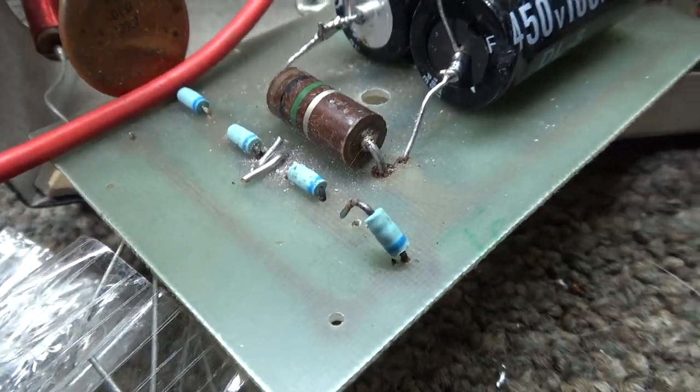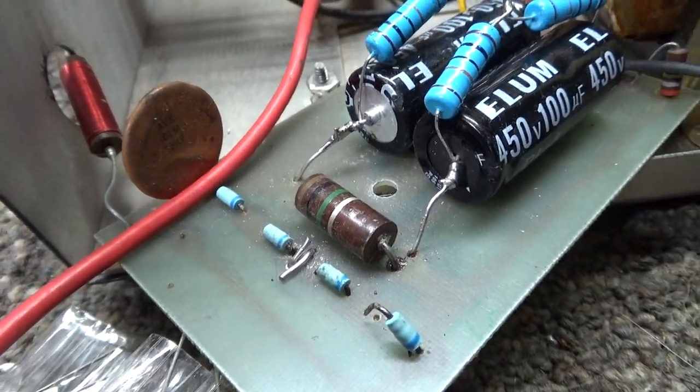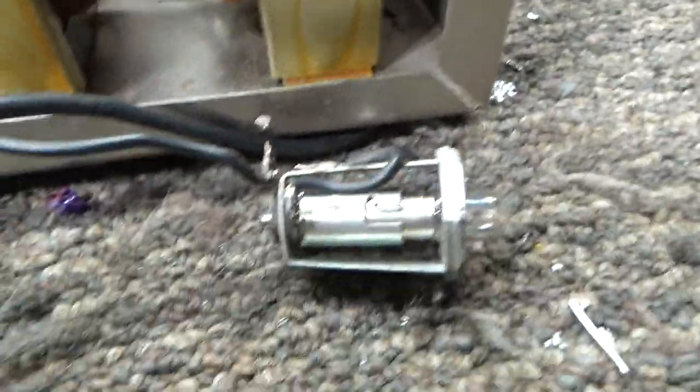And on diodes, they usually short more than they open, just like at the beginning of the video, dead short. And all four of mine there had a dead short in it, so I'm going to replace them. So that's why we did this video. That's an update on the diode testing and how to test a transistor.